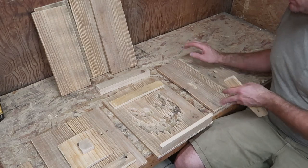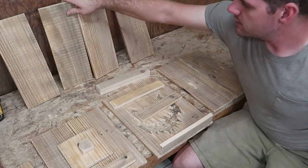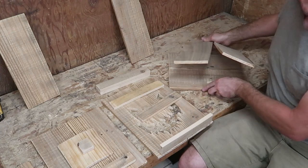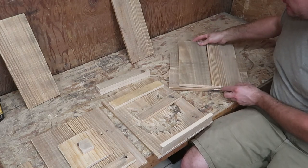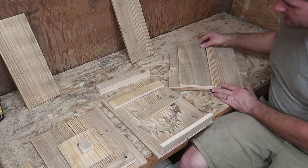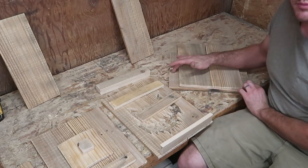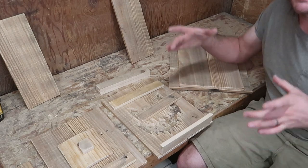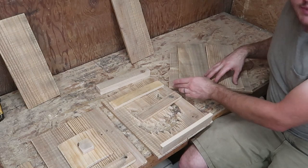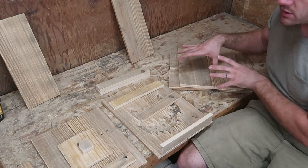Now as for the bottom, what I did, and I'll show you here at the back pieces, is I took back and front, which are the same width, and to show them directional here for you, I laid them on a board and I gave it a little over an inch overhang, like inch and a quarter, inch and a half, what looks more pleasing to the eye essentially, because I want the bottom to be a nice stable base and then the top to be just in a little bit from that. So for the bottom, like I said, inch, inch and a quarter, inch and a half, whatever looks the best for your material, which may change in width.